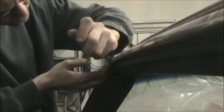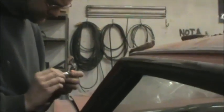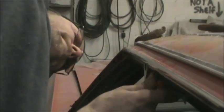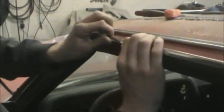If any of you folks out there have ever tried pulling and reusing steel siding, it's kind of the task we're asked to do on this trim. You can get this in here gently. Just rock it. You're not putting a lot of pressure on it. Take this, put it up in the window trim. Take my panel popper. As long as you can get it to roll, it'll be twisted when you pull it off. Don't worry about the twist. It's not going to hurt you in the long run.